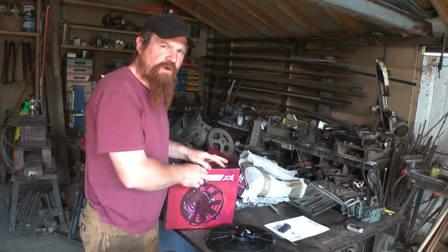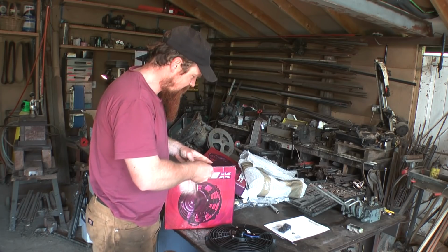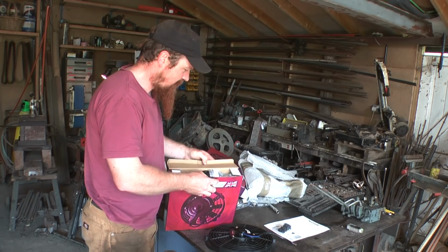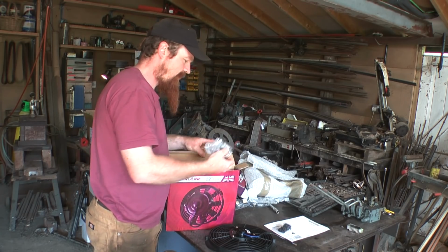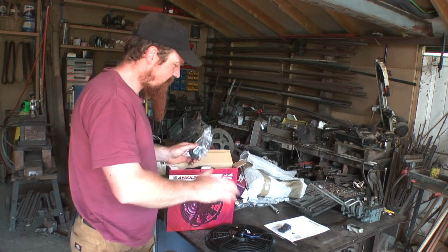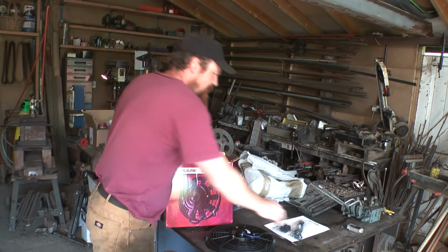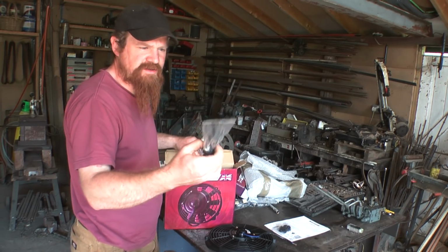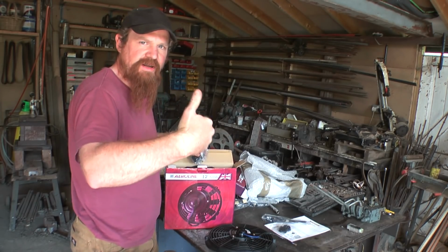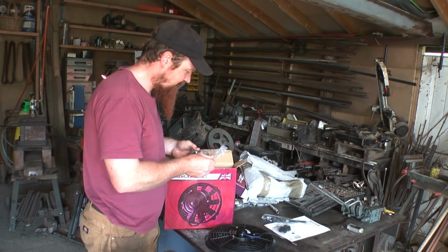So I've got two 12 volt fans, even though it's going to be a 24 volt system, because they're much cheaper. Obviously 12 volt stuff's much more readily available, there's much more of it. Plan is then to run them in series, so chain them together. This is the fixing kit that comes with it. It's just a sort of glorified cable tie that you're supposed to attach onto the radiator itself. I'm not going to be doing that, I'm going to make an actual bracket for it.